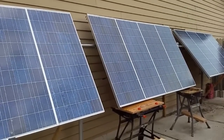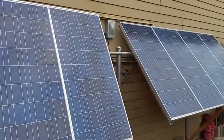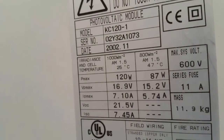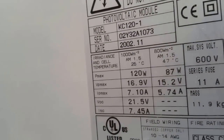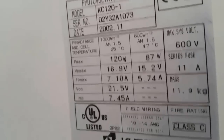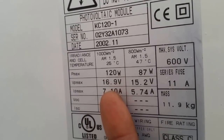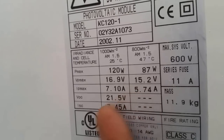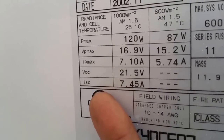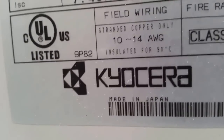Okay folks, this is the system — 10 solar modules, same voltage, same manufacturer, same metal, same amps, everything. Now just a little panel like this can produce 7.10 amps at a VOC of 21.5 volts. This is what you want for a battery backup system or grid-tied. Low voltage and higher amperage makes it good for charging batteries. It has a lot of amps for just 120 watts. The ISC peaks at 7.45 amps. These are the brand new Kyocera ones.